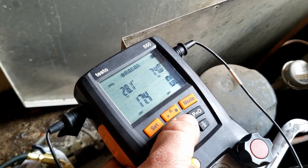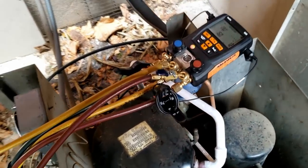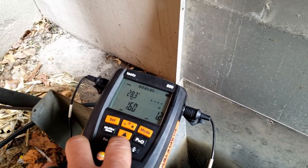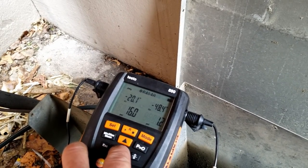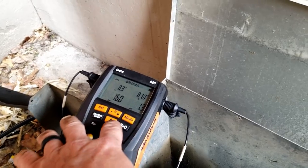We're on 404, we're on 28 degrees, we're at negative 18. So yeah, we're getting a better look here at this. We're running 28 degrees, you want a minimum of 20 back at the compressor, according to Copeland. We've got a negative 20 evaporator temperature, 8 degrees suction line temperature. It's 70 degrees or better inside, so it's going to sit there and freeze up.